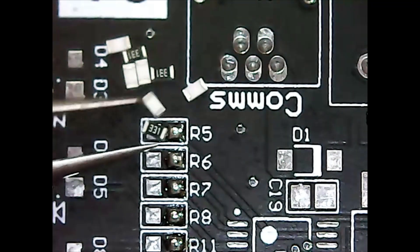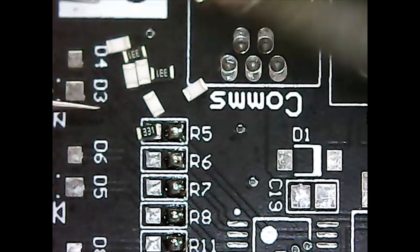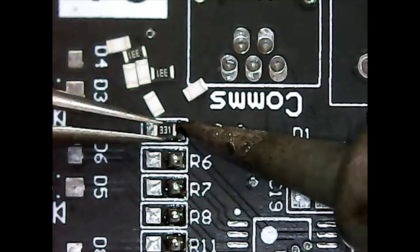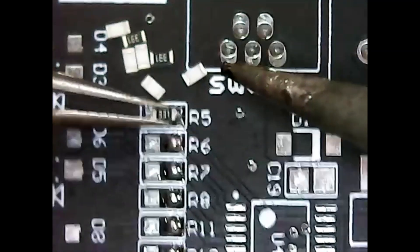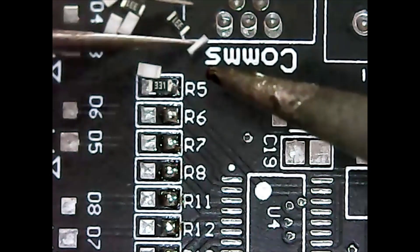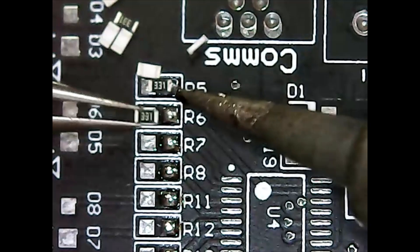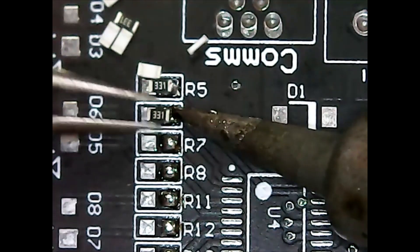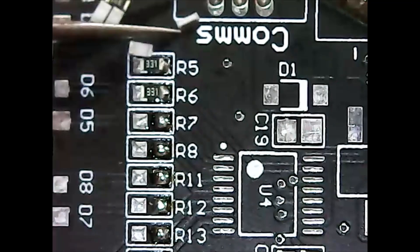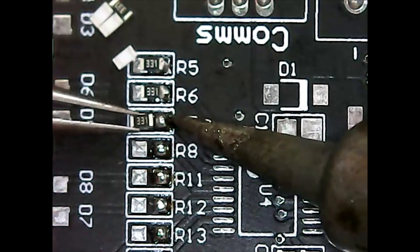I try to make them align so that the resistor codes are all facing the same direction. With my soldering iron, I'll heat up one pad and insert the component. That's not a great joint — that's actually a cold joint. You can tell because it has a tail; if it has a tail, you have a cold joint. A cold joint is a catch-all term for any kind of bad solder joint, although typically it refers to joints that don't have enough flux proportional to their temperature.